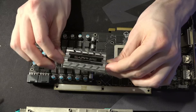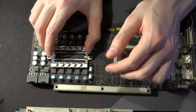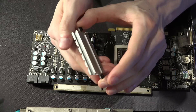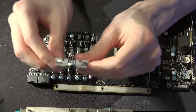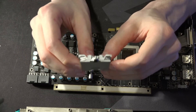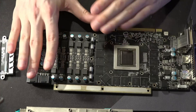They also have this little aesthetic plate over here — it does have some surface area, but it's mostly an aesthetics thing. They've actually covered up a good chunk of the finnage with the Sapphire logo piece. Anyway, the VRM runs really, really cool, at least with water cooling. I don't know how well it works when you're actually running this heatsink, because the air that this VRM is cooled with would be air that's already gone through the fin stack — significantly higher than ambient temperature.